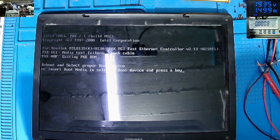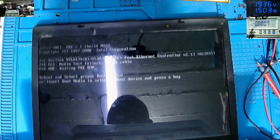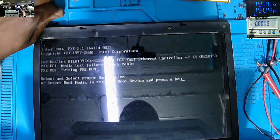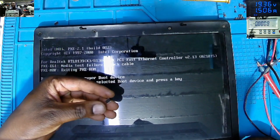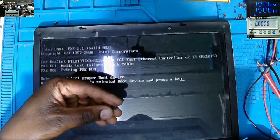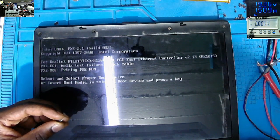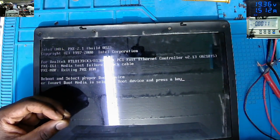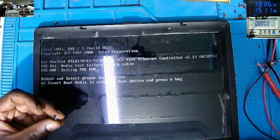In our case, we have a blown up chip. I don't know about this chip. You see, the chip is written, where's that chip? That's here. This chip was written PS51020, but it must be TPS51020, a dual step down controller for 3.3 and 5 volts. The chip was blown up.